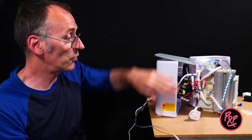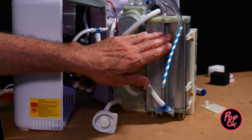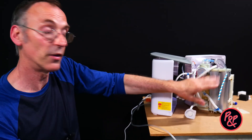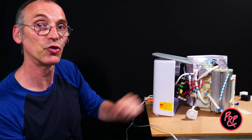What we intend to do now is take apart this sieve column, take out the molecular sieve inside, replace it with activated carbon, put it all back together, and hopefully produce a nitrogenous airstream — one that will put out a flame.